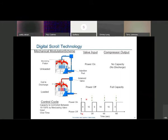If we get 100 people into that theater as load - just using people as a means for following load in this illustration - the compressor loads up at 100%, meaning the solenoid valve is de-energized for the full 20 seconds total. We time average that out. Of course, the compressor follows the load happening within that space. For freezers or cooler applications it's a little different, but this illustrates what load means.